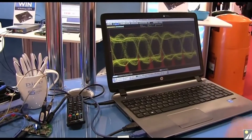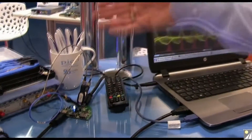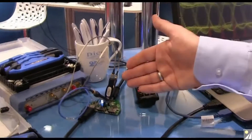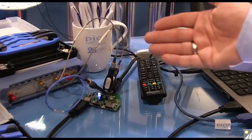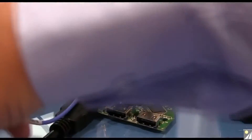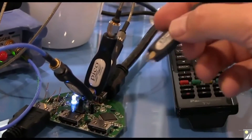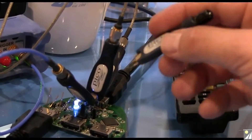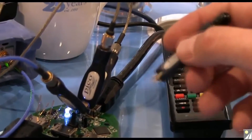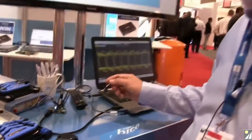So what's so important about these new probes? First of all, they're small and very lightweight, provided with flexible cables such that we can probe by browsing with our hands or by soldering in to very fine line geometries — as we have to deal with today with gigabit data streams or high-speed microwave signals.